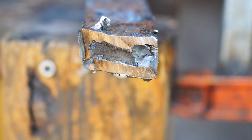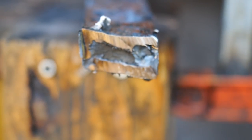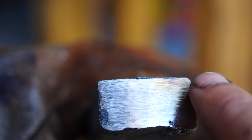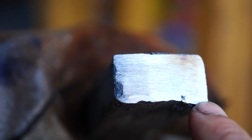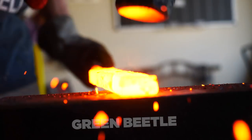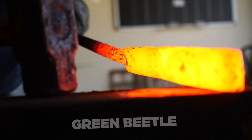You can see when we cut the ends off the canister there's that gray powder-looking stuff — that's actually the graphite stuck to the end. Grind it off and you can see we have solid steel underneath. You can even see the canister as that lighter steel with the middle steel being our compressed powdered steel with the drill shavings in it. I'm going to compress it a little more under forge welding heat to close up any remaining gaps.